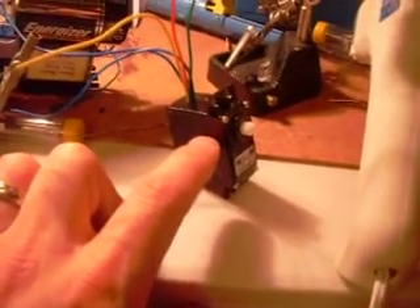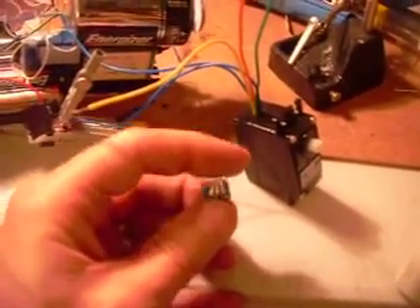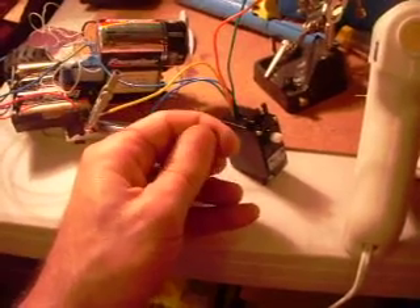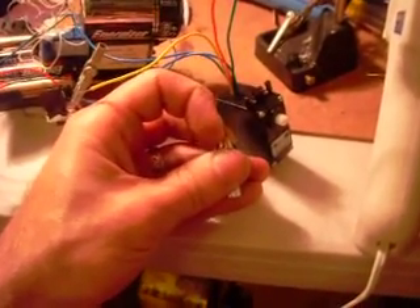So I added a rotary encoder inside. The encoder came to me looking like this — it's got three little pins on it, and these pins over here are just stabilized, they don't do anything electrical. It's got very obvious detents as you turn it around. I think this one has 30 detents, so it makes a difference every click — 30 clicks per revolution for this encoder, which is pretty good.